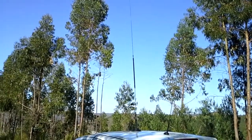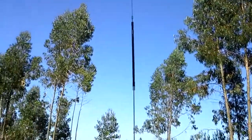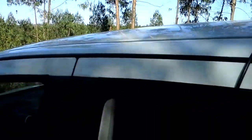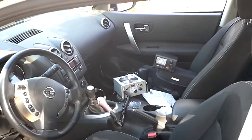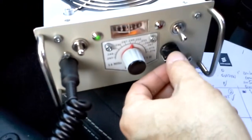It's about 2 meters long — in fact, 2.10 meters long. And as you can see there, there's the center coil. For the first observations, it seems to perform really, really well. That's an amazing antenna. I have other antennas from Diamond — the HF20FXW, which is a base-loaded mobile whip antenna. It's only about 1.5 meters long, and it's a very nice antenna that works well on my QRP setup.